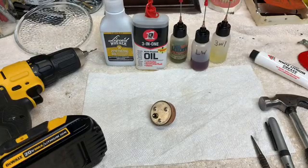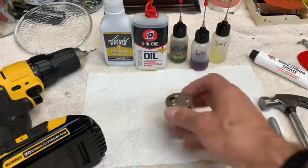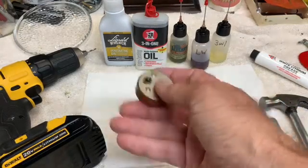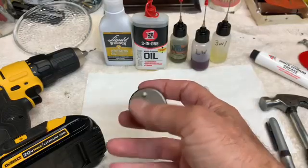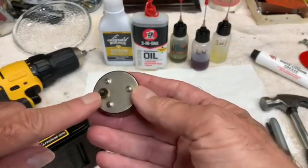Hello. With this video, I want to show a technique that will allow you to repair frozen telecron rotors. If you've tried to repair any telecron clocks, you've most likely come across one or more of these that just didn't work. A lot of these were built in the 1930s and 40s, so they're in the neighborhood of 80 to 90 years old. What happens is the oil that's in them dries out, gunks up, thickens up, and the output gear here just won't rotate any longer.